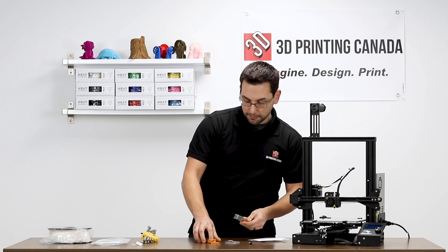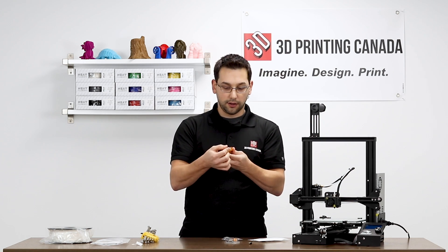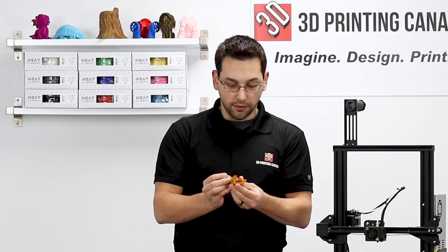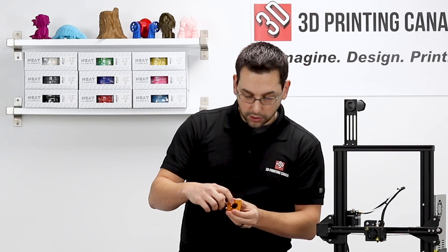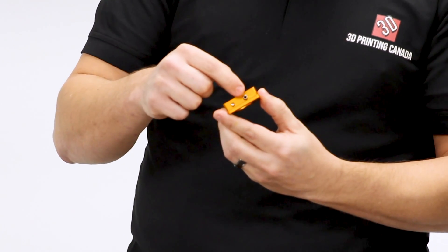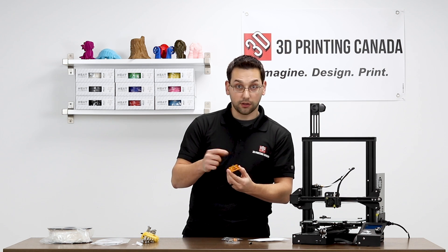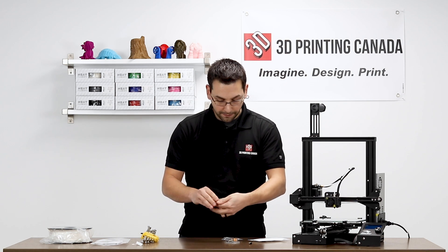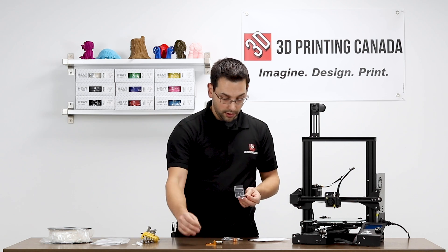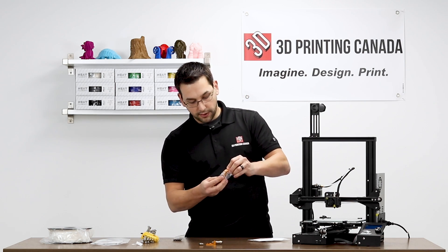So we have the main component. It's all aluminum, it's anodized. There's an upgraded coupler for the PTFE tube. And there's also what almost looks like a heat break threaded through here, and that's to take up any gap that would exist between where the PTFE comes in and where it contacts the drive gear. We'll cover that in more detail in a minute. There's another coupler, and then the lever part of the assembly.